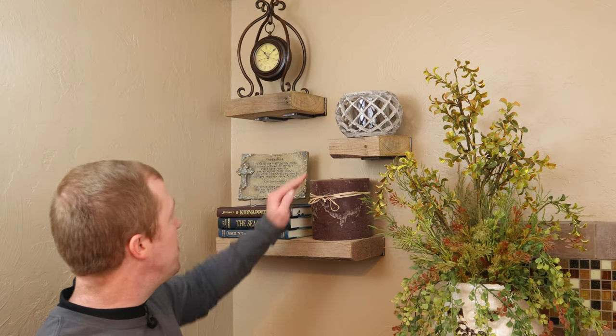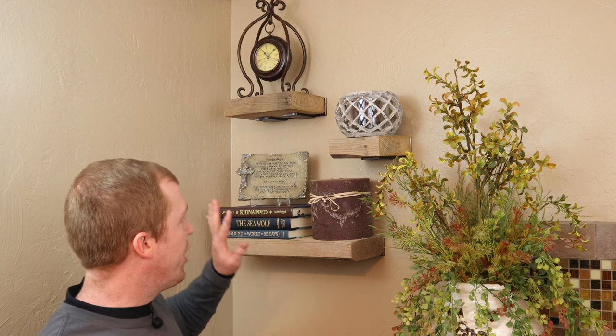There were a couple things we probably could have done a little differently — the main one being that with this old wood having a slight warp to it, we should have tilted those brackets up a couple degrees just to make it a true flat shelf. But besides that slight slope forward, the decorations are sitting up there nice and securely — I'm gonna say successful project. If you want to see other projects like this one, be sure and hit the subscribe button down below, otherwise I'll catch you on the next one.